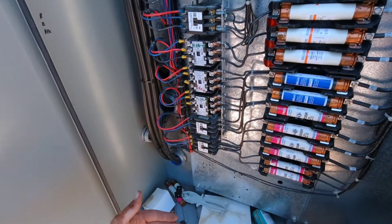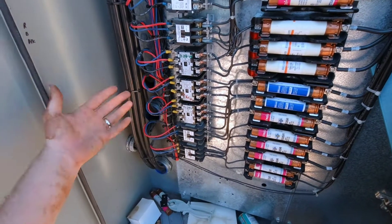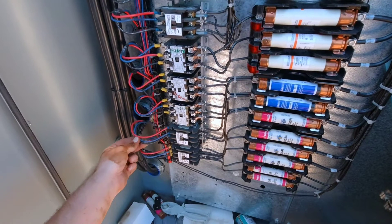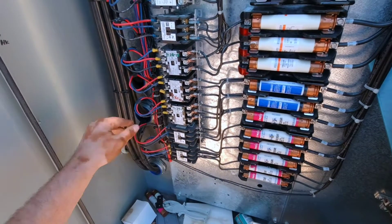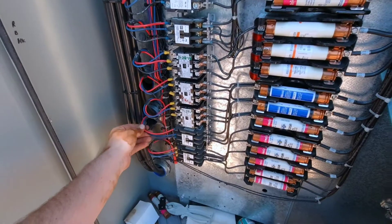The harness was good. The other fan was good. It was just that one fan. They already had a replacement fan on hand — this is just part of having old equipment, you keep stuff around for this exact scenario. Switched it out, it's good to go. We're back online and moving on to the next one.